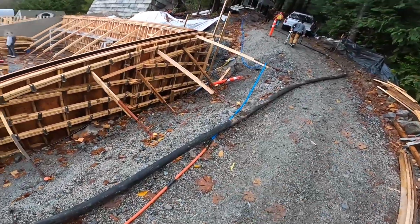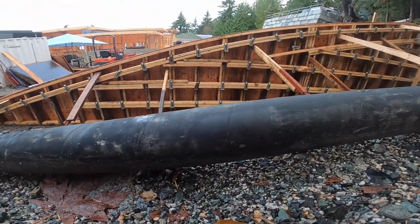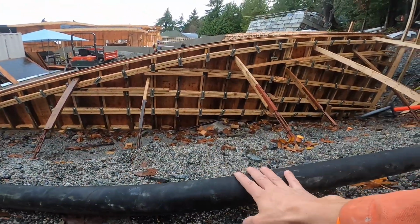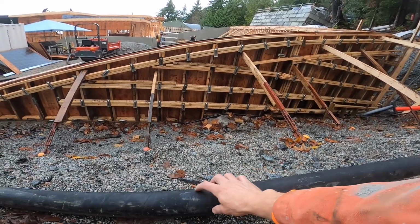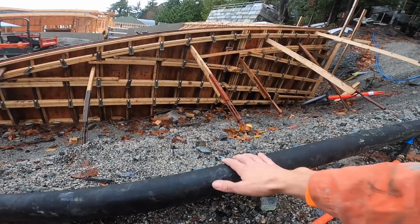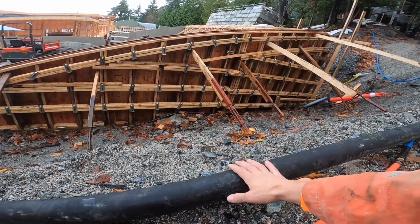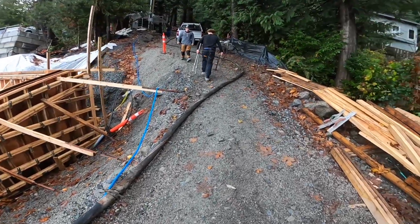If it slides ahead of the concrete, there's potential that it only coats the bottom half of the hose, leaving the top half still dry. So we want that nice slug of primer to coat the entire diameter. So when the concrete comes through, we don't have the upper half of the hose still dry, robbing fines from that material. So very, very important when priming downhill.